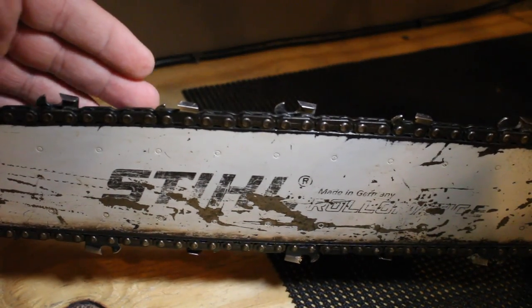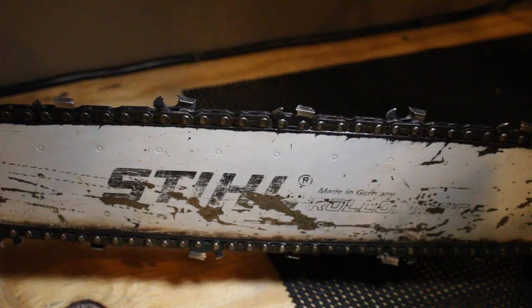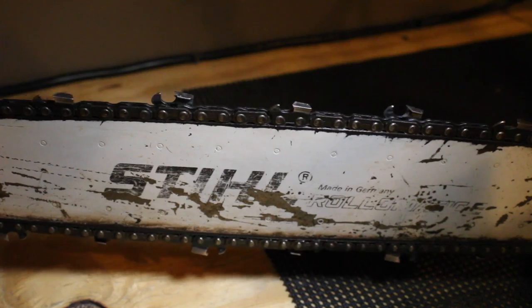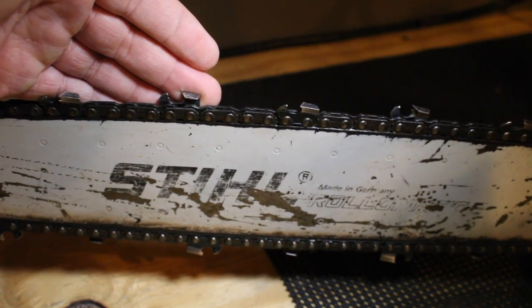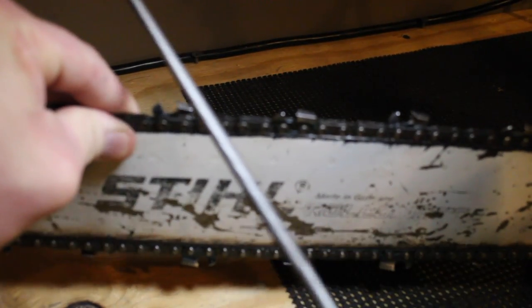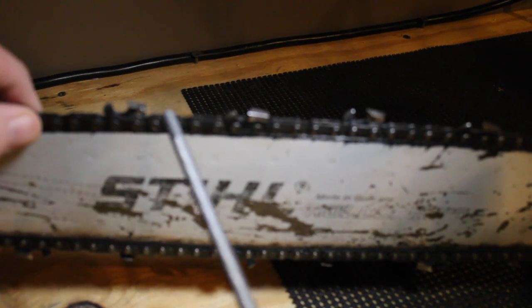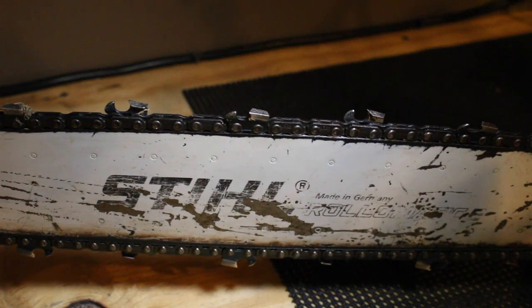What I like to do is start on the side that is more difficult for me, that doesn't feel natural, because you want to do every other one — you don't want to sharpen one tooth from the wrong side, it's facing the other direction. Get that from the other side, or turn the saw around. Sometimes I'll run the chain through, look for the worst one, and say that one needs the most work. Let's say it takes five strokes to where I'm happy with the point sharp — then move to the next one and do five there, and go around the chain that way.